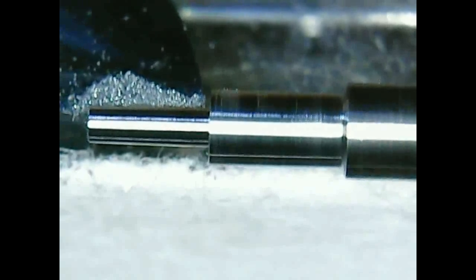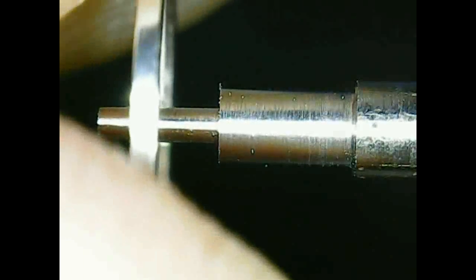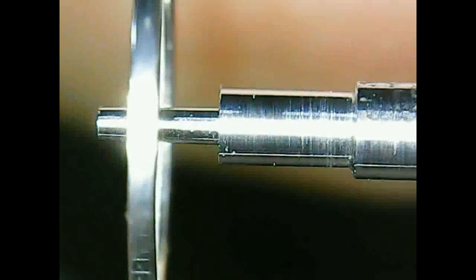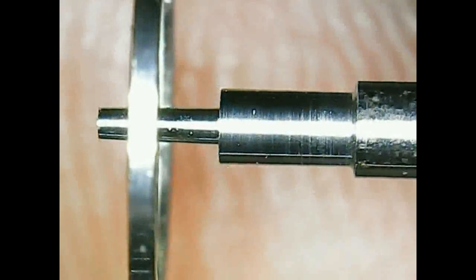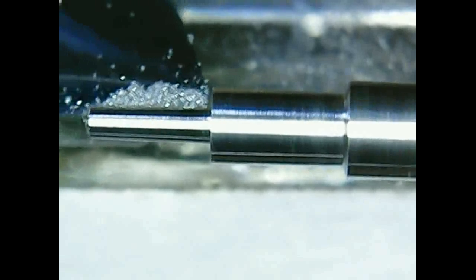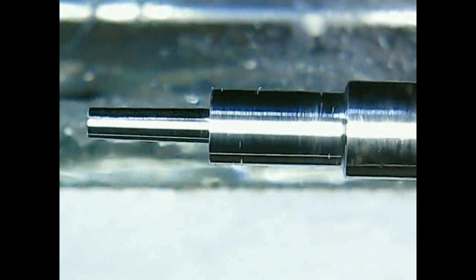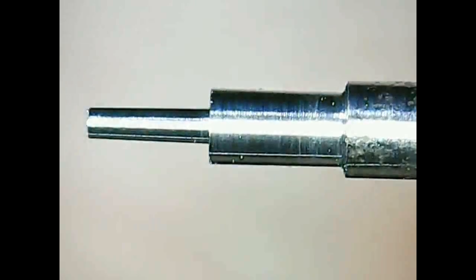So this collet lathe has the benefit of having much more room for the graver, but the drawback of this turning is one can't remove the workpiece, because when we put it back to the collet, it won't be concentric again. With turning between centers, one can remove it as many times as needed and measure with the gauge, so one can measure the exact sizes, diameters and lengths.